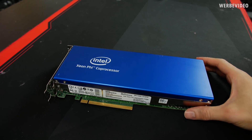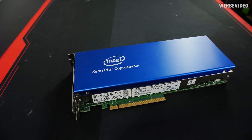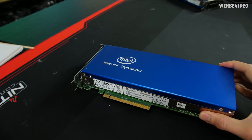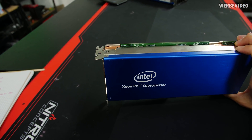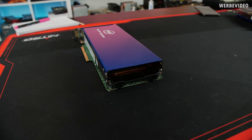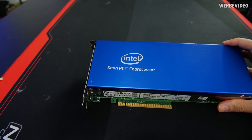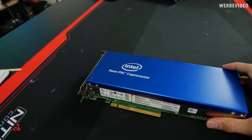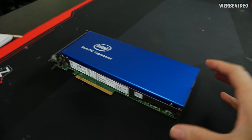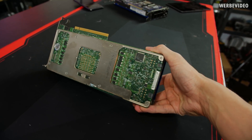Underneath this beautiful blue Intel cover we have a Xeon Phi 7120P - first-generation Xeon Phi, Knights Corner. The first impression: it looks like a VGA, and some online databases also list it as a VGA, but it's not. It's a coprocessor which has 61 CPU cores and uses hyper-threading to transform those not into 122 as you'd assume, but into 244 threads - turning one core into four threads in total. The outer shape just looks like a VGA, but it's not.